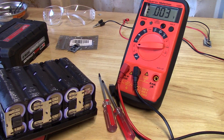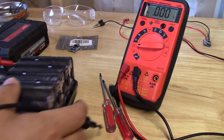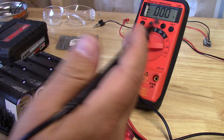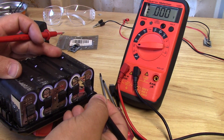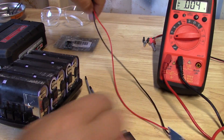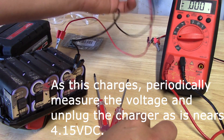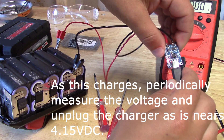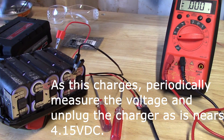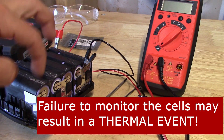That's where polarity comes into play, and that's very important. How you're going to make sure you have the right polarity is to use your multimeter and make sure it shows no negative. It says 3.68, and the black or negative side is touching this side while the positive touches this piece — you're going to mimic that with your charger. The little lips here work out great for alligator clips. We'll now take our USB-C and plug it in — you notice it goes red, indicating it's charging. This is going to take a while, so I'll charge these up and just show that the process does work.